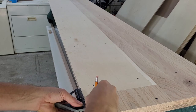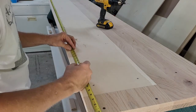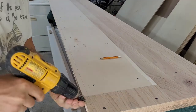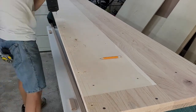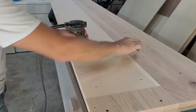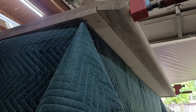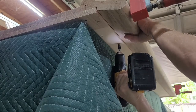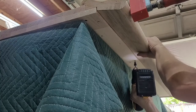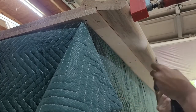While the glue was drying, I laid out mounting holes on the underside of the top. I marked a line half the distance of the first overhang, then marked the screw spacing. With that done, I used a taper bit and countersink in my drill and pre-drilled all the mounting holes. The last step was to sand off the lines and any burrs created during this process.